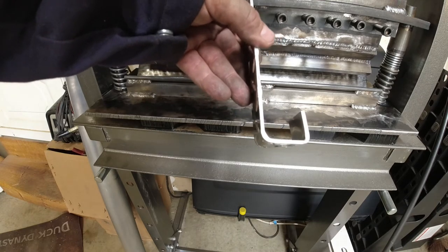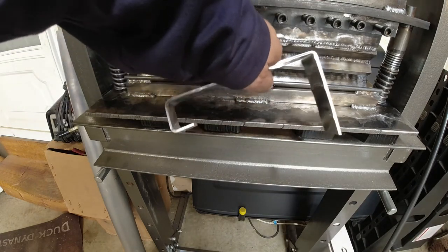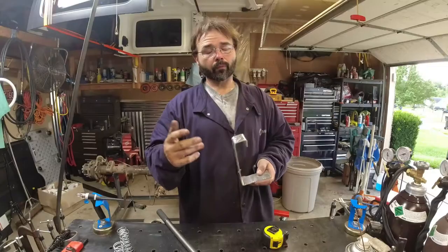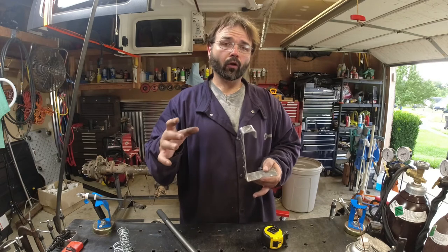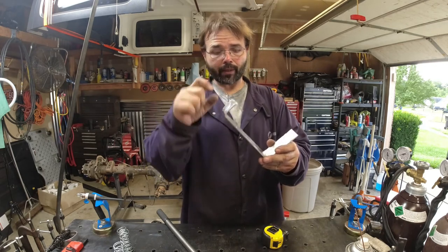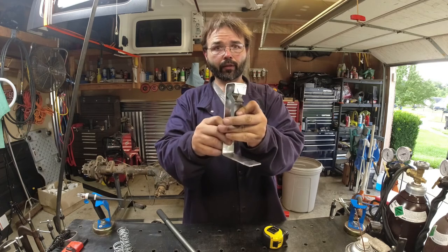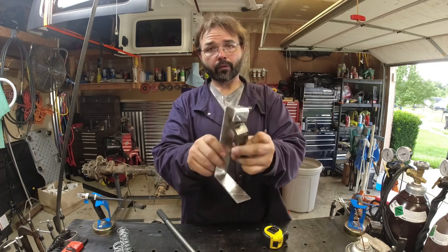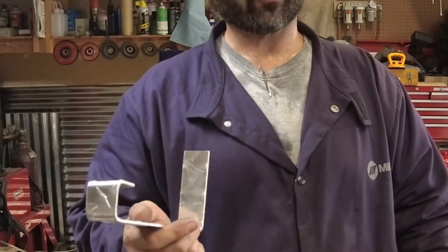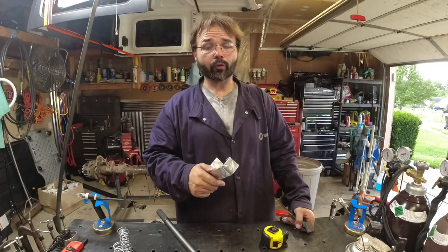For what we're looking for it worked well, and if I decrease this a little bit more it'll only work better. We came just short of the upper half of this finger, so that all worked out pretty good. That was modifying our Harbor Freight arbor press finger die so we can make tighter bends and make segments. Now if we need to, we could fold up and stick that smaller finger up in there — it's a lot more diverse now. Most of the work on the original build was in the upper half of that die, and it was the same for this one as well.